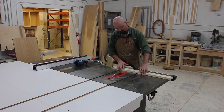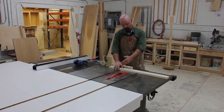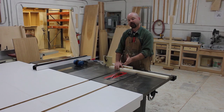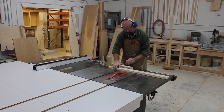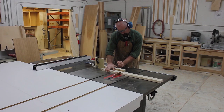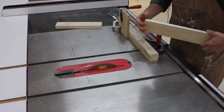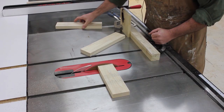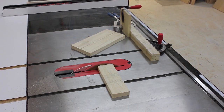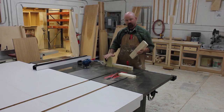To make this cut, I'm simply going to have my board against my stop block and against my miter fence. I'll grab the miter gauge here and pinch the workpiece up against the fence. I could do this cut with the blade guard on, except I want you to see the stop block and the miter fence, so I'm removing it strictly for clarity. I'm holding the workpiece firmly against the miter fence, I push forward, and I pull straight back. I don't try to remove the workpiece until the miter gauge is fully retracted — if I did, the workpiece could get caught between the stop block and the blade and kick back.